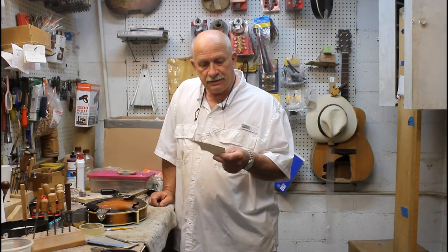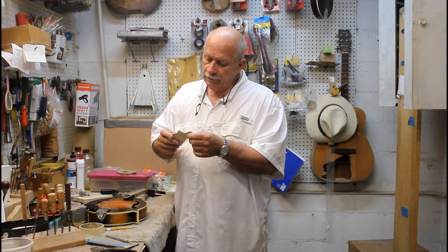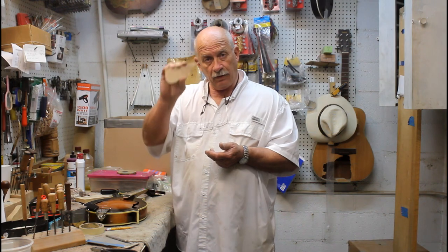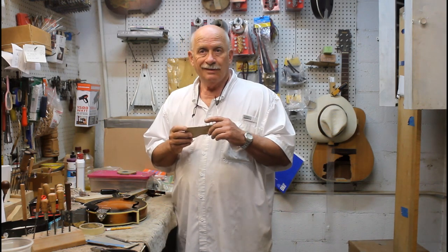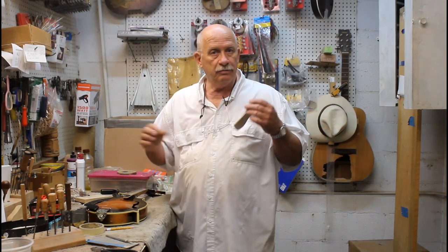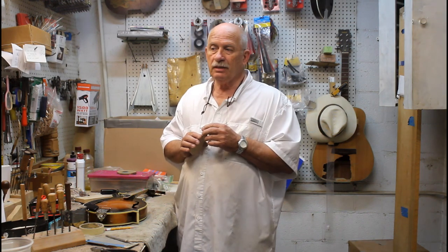And making it pretty consists of taking care of that bevel that I told you about before to get rid of that glued-together seam, and then cleaning it up, sanding it down slick as we can get it, and putting some sort of finish. For this one, we're going to stain it brown, and then some sort of protective coating over top of that. With pickguards, I do not like to use lacquer or anything that actually builds up on the surface and can get scratched. I would rather keep it with some sort of finish that the customer can easily fix. So either a clear Minwax or an oil finish, even if it's nothing more than lemon oil, Danish oil or something like that. And then I will usually just hit it with steel wool.